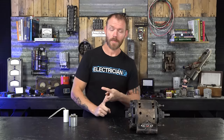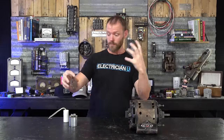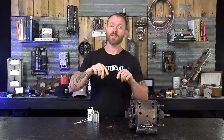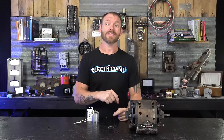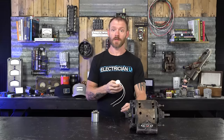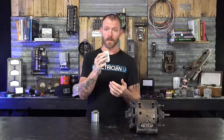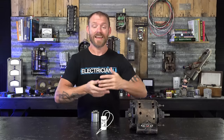There are two other kinds of capacitors you might come across. A dual start-run capacitor combines a start and a run into one capacitor — typically it has three leads: one common terminal for incoming power, one lead going to the run winding, and one lead going to the start winding. Then there's a dual motor run capacitor, which is one run capacitor providing capacitive reactance for two motors simultaneously — for example, providing reactance for both the fan and the hermetically sealed compressor at the same time.